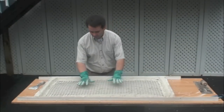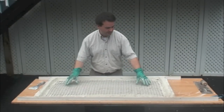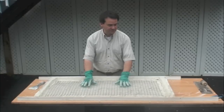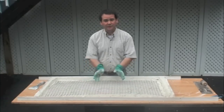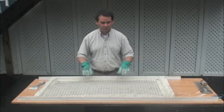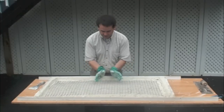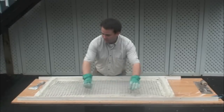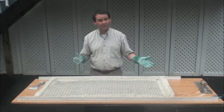We've got all of this concrete covering the face. We've now cut this piece of reinforcement so that it goes in there to make it nice and strong. If there was a sink going in this particular vanity, we would put some strong 3/8 re-rod in on both sides — because taking out the sink takes out part of the strength. So we would have to put full-length re-rod going on both sides of those weak points so that you don't get any cracks.